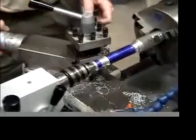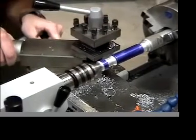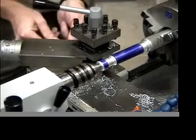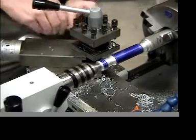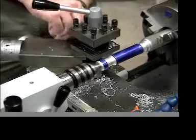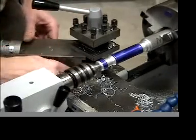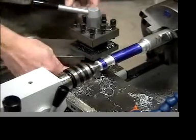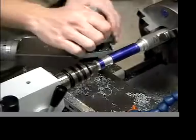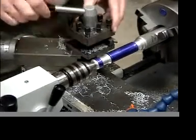And then I move my tool back. There's a little line over here. We line that up with the 45-degree mark on the lathe here. Tighten it down again. And then we're going to straighten out the tool again. Remember that the tool should be straight forward and backward. We don't want it to be on an angle at all. Okay, so the tool is straight ahead.